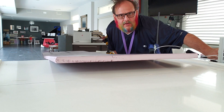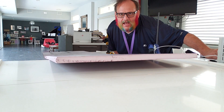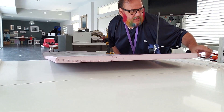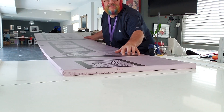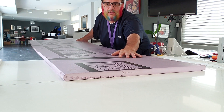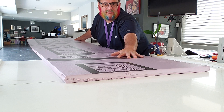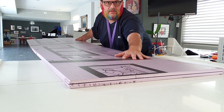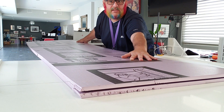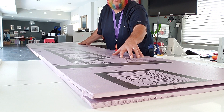Okay, we've got power on. Let it come up to temperature, let the amperage stabilize — give it a couple of seconds to get hot. That wire gets hot pretty instantaneously, but let's just let everything stabilize. The amps aren't moving around anymore. Now we're going to feed this board in. The feed rate is very important — you want to be watching the wire, making sure you're not stretching it. You're letting the tool do the work. So I'm just going to drive this board into that wire and let the wire cut. There it goes — you can see it just sink in. I'm just pushing a little too fast, so just let it find its way through.